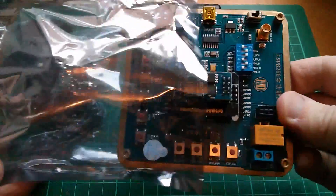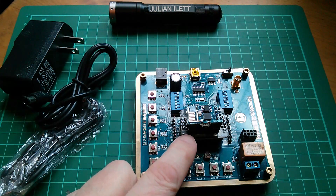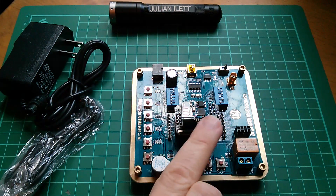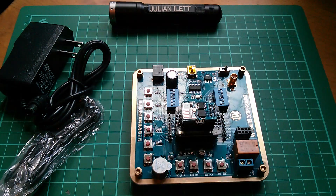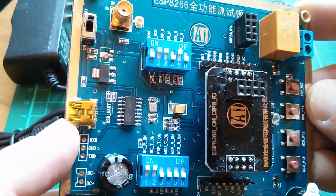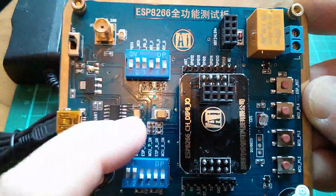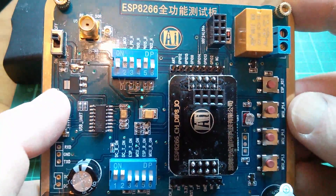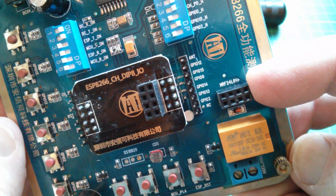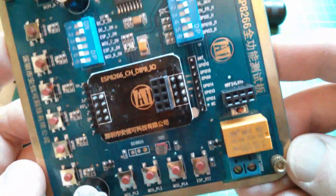The other thing in this envelope is this board — an ESP8266 sort of test board module for experimenting with these Wi-Fi transceivers and microcontrollers. There's a USB socket here that goes into a CH340 USB to serial. There's a 3.3 volt regulator to power this module. Interestingly, it also says it takes an NRF24L01 plus, which is the 2.4 GHz data transceiver. So it's kind of dual role from what it looks like.